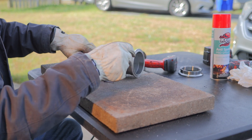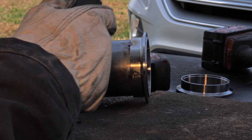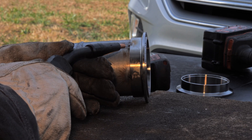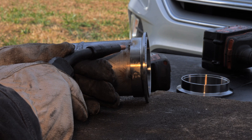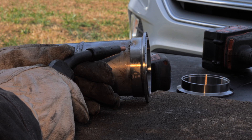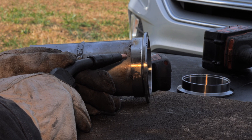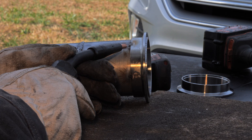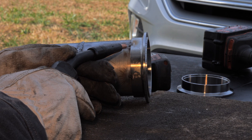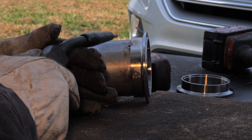Like I said in my other videos, you always want to be comfortable — you want to control it. What I'm gonna do is put a little more heat into the stainless right here and then come down to the mild steel. If that doesn't work I'll do the mild steel first then the stainless, but if they want the same amount of heat I'll adjust as I go. I'm gonna do C's — I kind of like doing C's. Control the puddle. Let's try that.